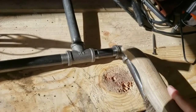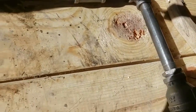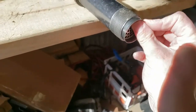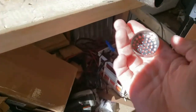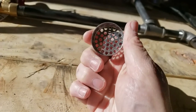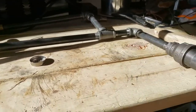Not only will they mix, they'll start to swirl — swirly swirly — down this pipe into our nozzle. This nozzle has a pipe we're going to use as our burner. This burner is going to have this little stainless steel screen I concocted here. The reason you want a screen instead of a full-out flame is that this screen will bust your flame into all those little flames — it's more efficient, all those little points of flame.